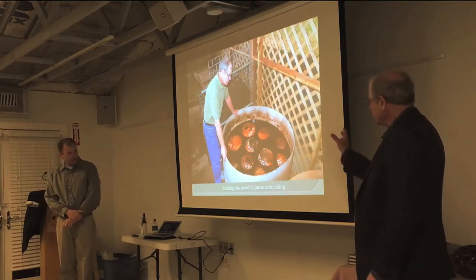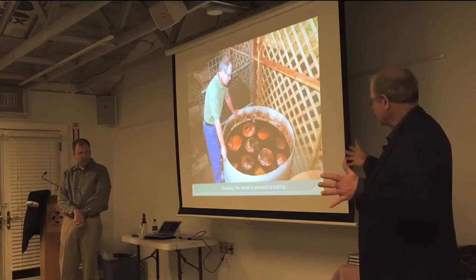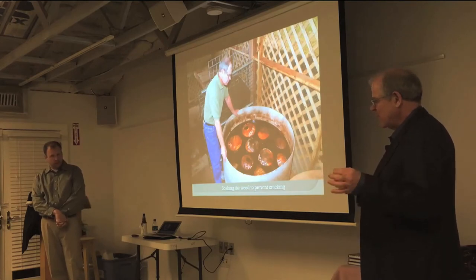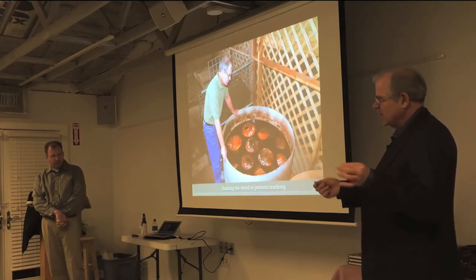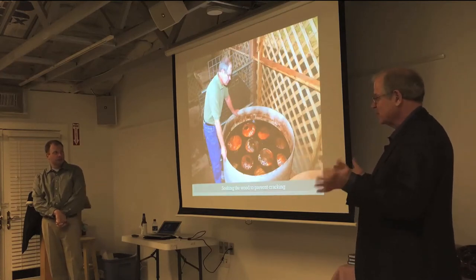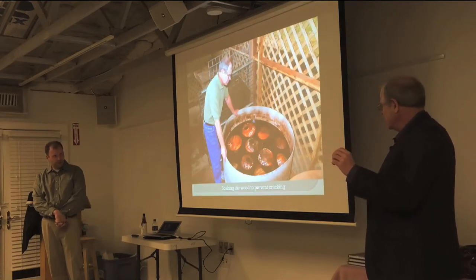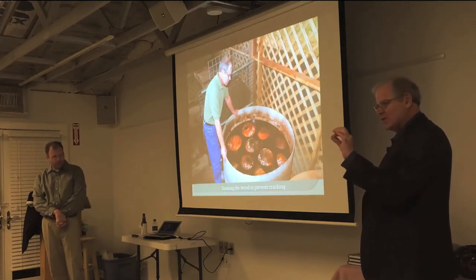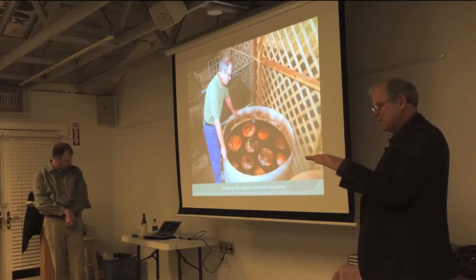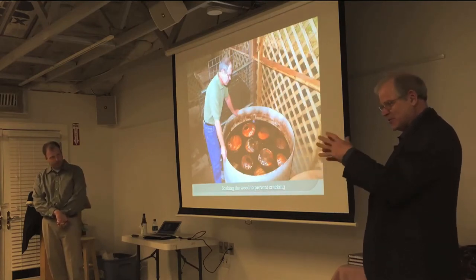All right, this is where certain woods that need it, we'll soak in our big water tub. We've got a couple of these. It's water mixed with polyethylene glycol, which is not antifreeze, which is ethylene glycol. This is what they use in hand cream and face cream and toothpaste. At room temperature it looks like paraffin wax, kind of whitish but sort of clear. It has no taste, no smell, no nothing. But if you warm it to like 105 degrees, it'll melt, or put it with water, it'll slowly dissolve.